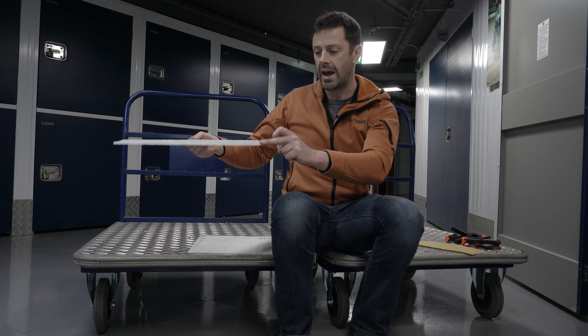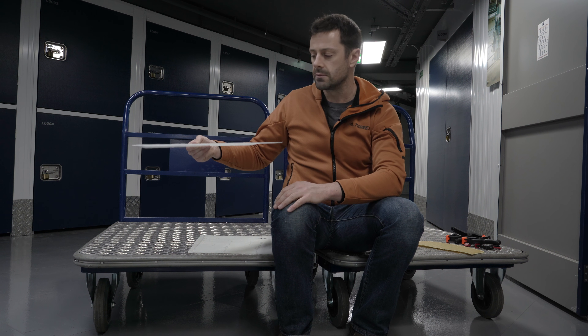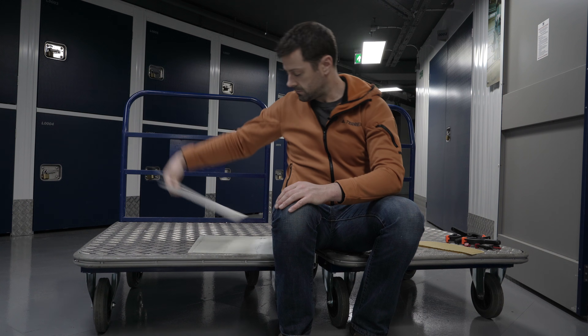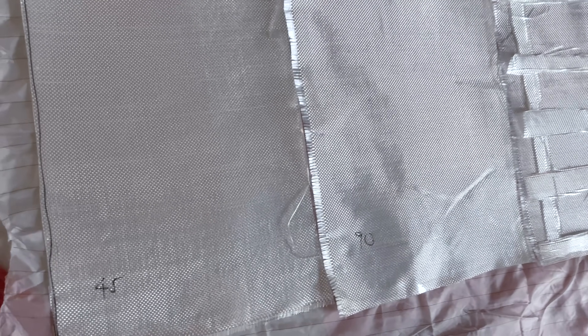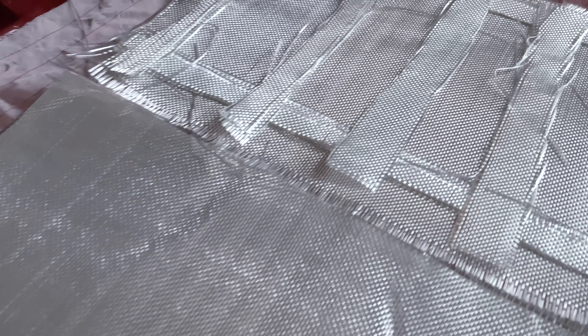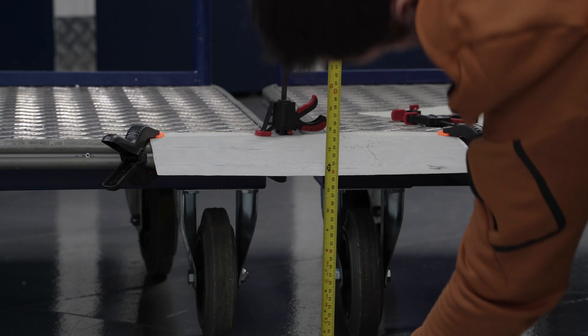We'll test which resists being pulled down at the corners, and of course I'll also test the centre, which would just be a normal bend. Instead of motion graphics, here's an easier, lazier visualization of the three layups: the mix of straight and 45-degree, the pair of straight layers, and then the ladder — a sheet underneath with the upper sheet cut into struts along and across. No 45-degree angle reinforcements in that one.